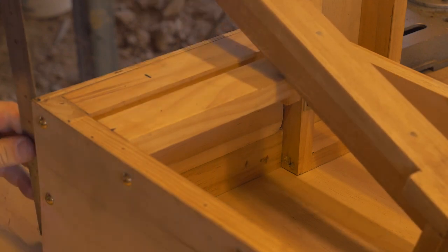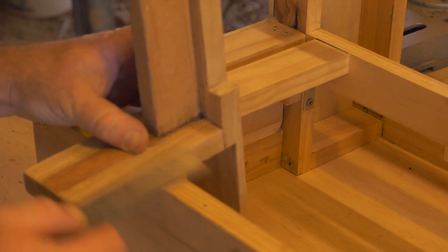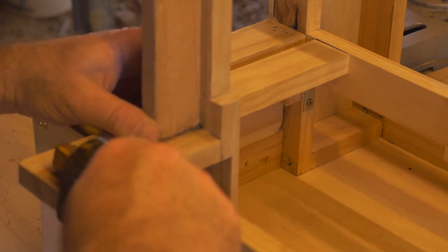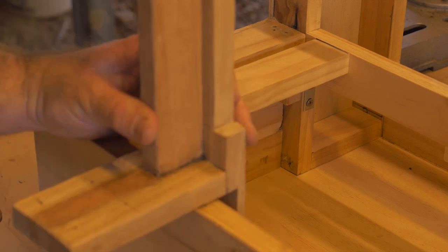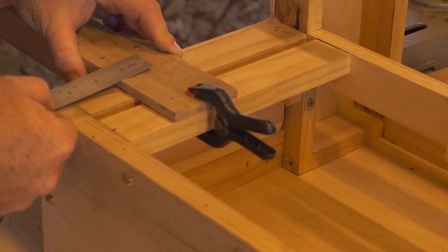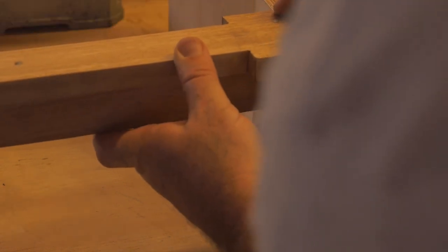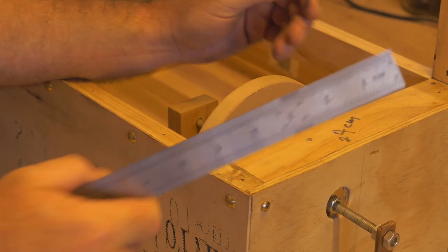It's around three inches in depth, so I'm going to use a ruler — make sure you measure yours as well — and mark it off. There are going to be four screws on this, one on each side. You'll probably notice a little strip down the middle; I put a little bit of mahogany on there to make it look different — you can do the same if you want. I've measured halfway, making sure it's sitting straight. I'm using a clip when positioning the guitar neck and drawing a reference line so I know where it needs to go. I'll clamp it on, and then I'm going to measure for the small guitar neck.